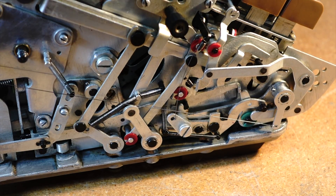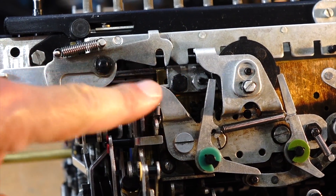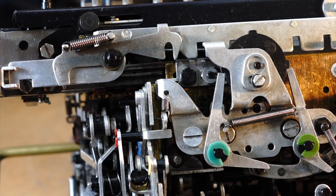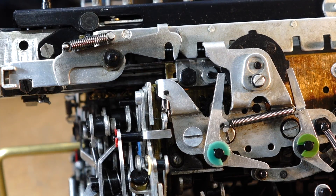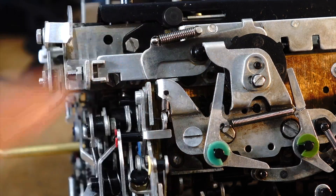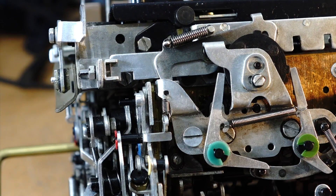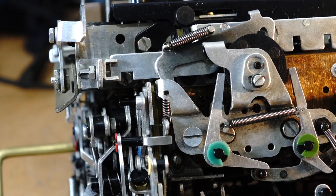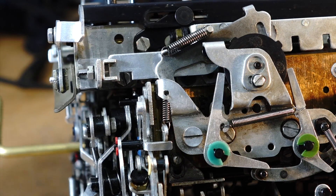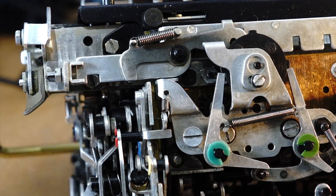So now that I found what started the multiplication and it wasn't working consistently, I had to find out what triggered it. And it's actually at the very end, at the other end of the machine — that mechanism over here. It has to detect when the carriage is at home position. So it's moving, moving, moving, and the last pin will actually push that lever down and it goes on that pin. See that one right here? It presses it down, and if you follow it through the machine, that's what eventually ends up on the other side to start the multiplication.